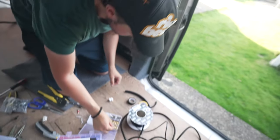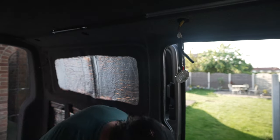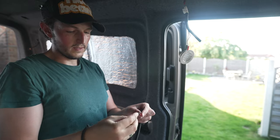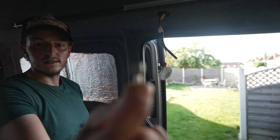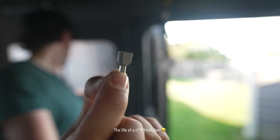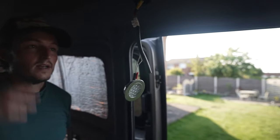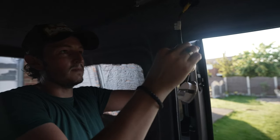The method I showed you earlier with the bullet connectors - well, because this is quite thick, about 1.5mm cable, it's hard to join two reds together and put them inside one of these little things, so I can't actually crimp them together. Instead, a friend of mine who's an electrician has given me these connectors. The idea is that my two reds go into this grey thing and then you screw down, that clamps the metal piece and keeps it in place - same with the black. I've removed the bullets from the lights, trimmed the wire, fed it up, and I'm putting a bit of conduit just to protect the extra excess. A bit of a different method - hopefully it's safe, the electrician friend says it is. Probably someone in the comments will say it's not!